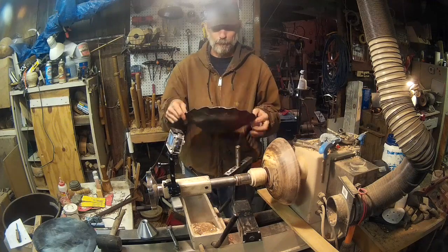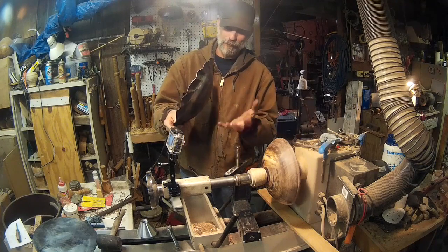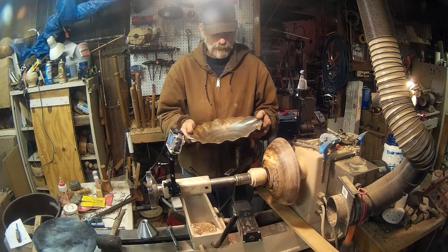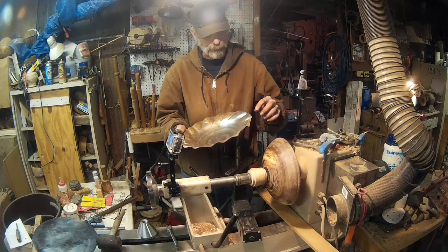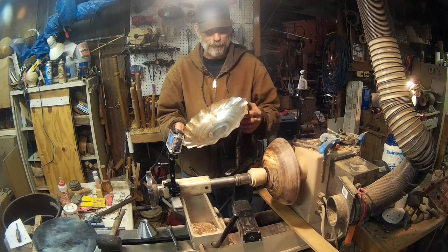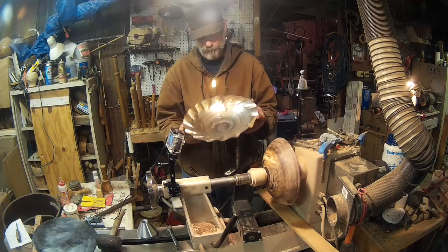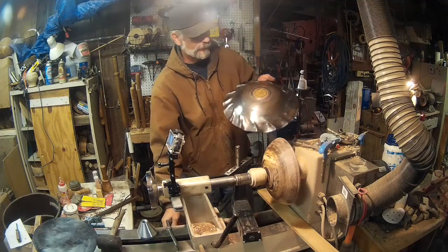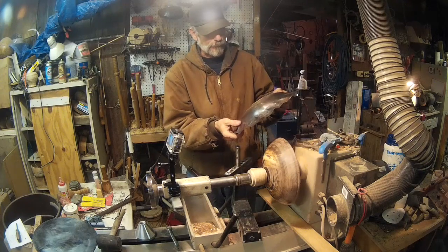Next, I took a piece of, actually it looks kind of cool, but I think I might just make a wooden base for this to stand on, a little pedestal, and polish it up, because it actually looks kind of neat. But this one, I did not pay attention as well as I thought I had to videos of metal spinners, but I didn't flare the outside edge, bend it before I started spinning it. So as it spun, it actually folded the entire outside edge. So that one didn't work out so well, but this was done with this tool, and at least for the most part followed the shape until I got out into here, and then it wasn't following the shape so well.